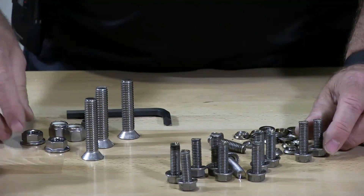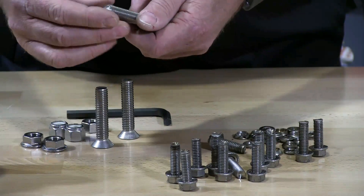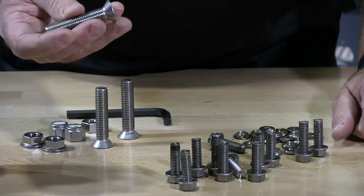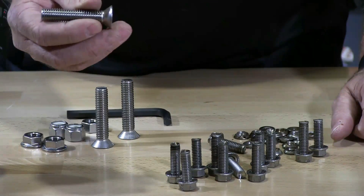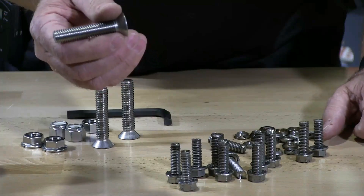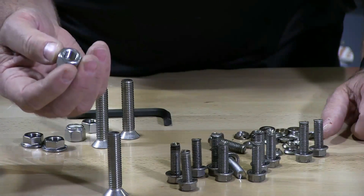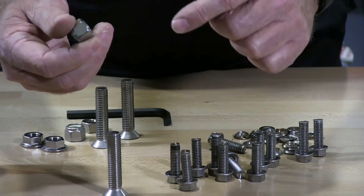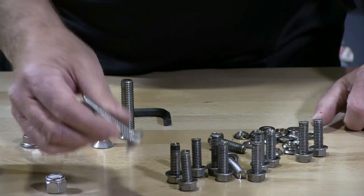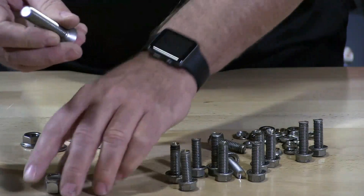Galling happens because of many reasons, but one specific reason is that when you manufacture a screw or a bolt, the threads are roll-formed. The nut is cut-formed — they have a tool that goes into the nut and thread-cuts the thread. The bolt threads go into a jig and machine and are roll-formed. So you have two different types of threads.